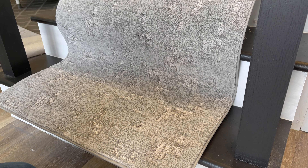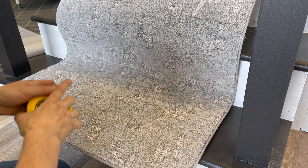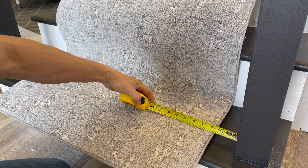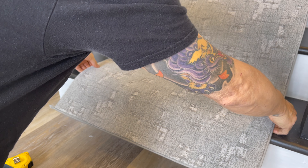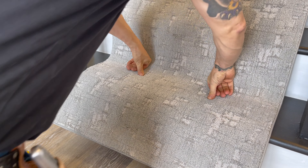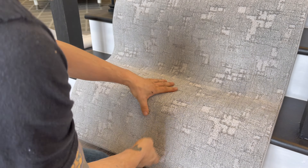I'm going to grab my tape measure. I put my hands on there, I can feel the under pad. I'm going to take my tape measure and check one side, then take my tape measure and check this side — two and a half and two and a half. It is perfect. I'm going to pull it out a little bit, bend it down over the edge, try to get that down and centered. With my fingers under there I can keep it centered because I can feel that. All right, we're centered.